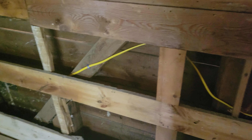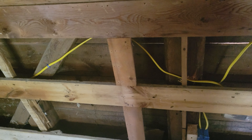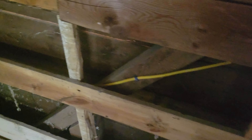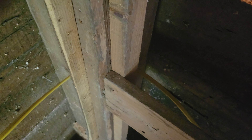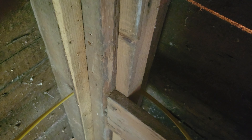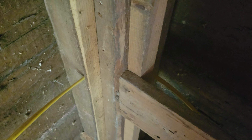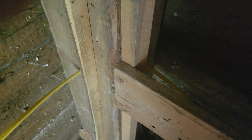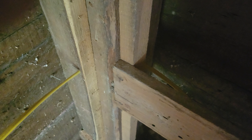Then we go up through here, and it's going between two sets of boards. This was relatively quick to string. One of my pride and joys has been doing pretty good at making corner holes. I have a special drill bit with a sort of a curvy angle in it — they're hard to find in the store that way. I got it in one side and down the other, and I think on the blog I'll put a picture of the little fish I made to fish the wire through. I didn't invent the fish, but I remembered reading about it and doing it before — it was in the same book on electricity I used 30 years ago. So this is the second corner.